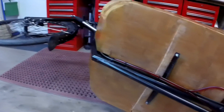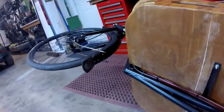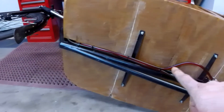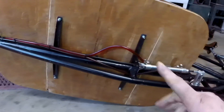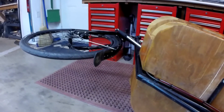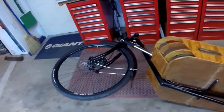It is maintenance free, there's no power required, really there's nothing you have to do. You move this and it moves that back and forth, just like that. Being on a steering system, the fluid in here dampens the movement just ever so slightly, so it runs very smooth. You evacuate all the air bubbles so there's no squish inside at all. And it works very, very well. It's been on this bike probably four years now.